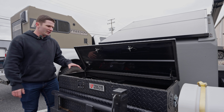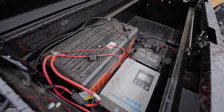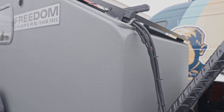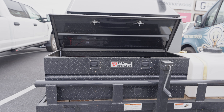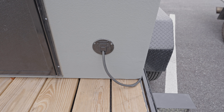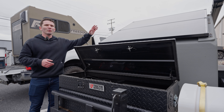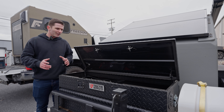On the flip side, the DC system we have here is a 300 amp-hour battery with a solar charge converter and 400 watts of solar — the polar opposite of what I have on my truck. This will run the 7,000 BTU air conditioner completely off grid; you don't have to charge it externally, though it does have a charge port on the front in case you want to plug into shore power. This setup was built to be permanent — all the toolboxes on the trailer are bolted down, the Freedom Camper is through-bolted to the decking. This isn't something you're going to take on and off the trailer easily, but because it's a permanent DC setup, you can mount more solar panels.